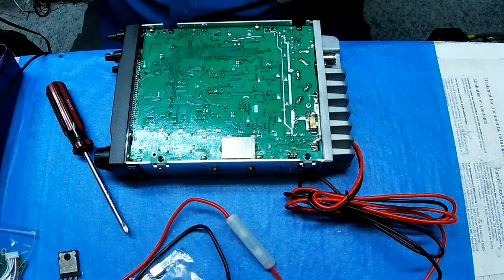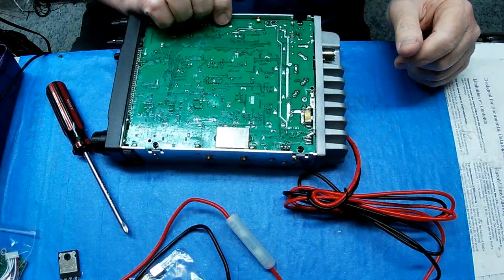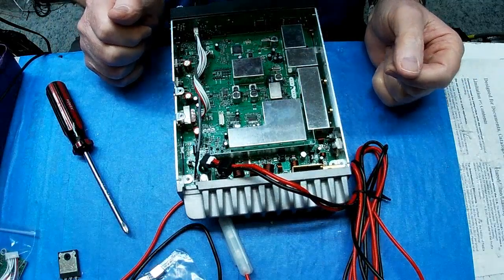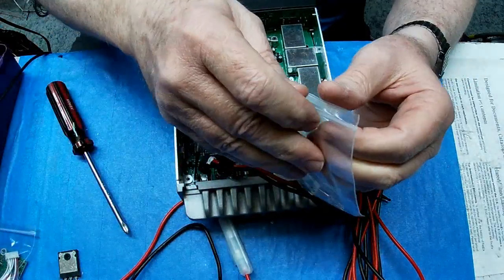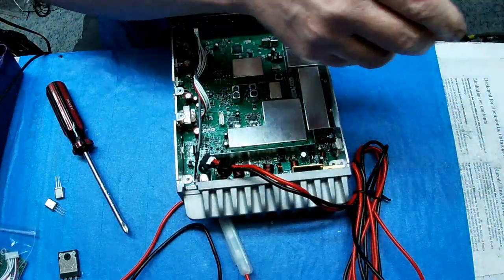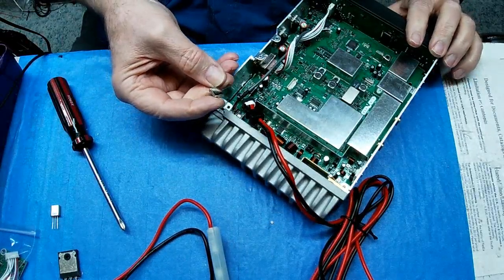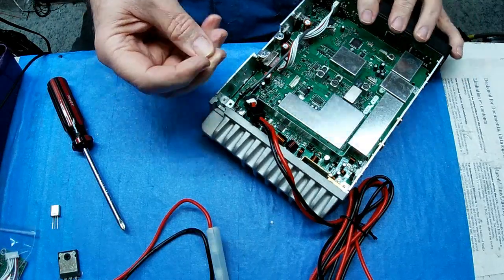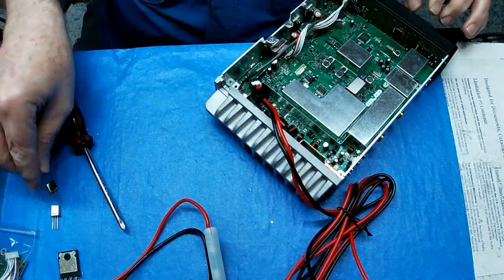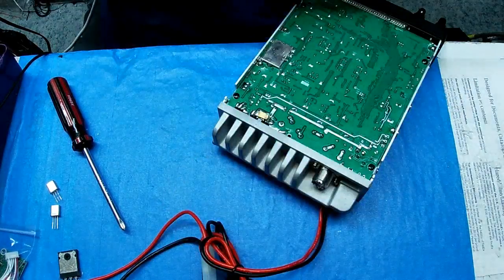I got a little catch spot right here in front of me. Got a little pan there that catches all that scrap solder. But most of the time, every now and then I'll miss it. Okay. I think we're going to put the new filters in first. These are 7.5, made by ECS in China. Of course, everything is made in China. And that center one, I can see right now, is not totally clear. So I'm going to redo it.